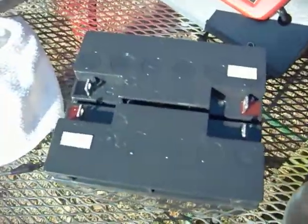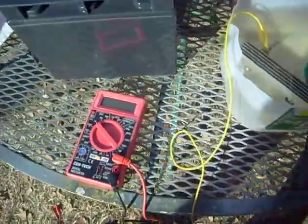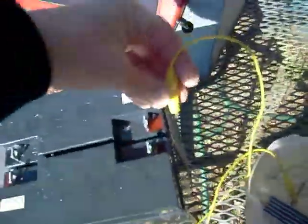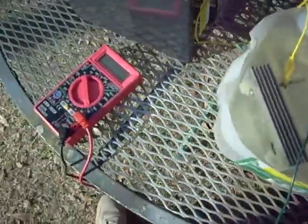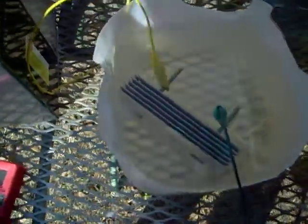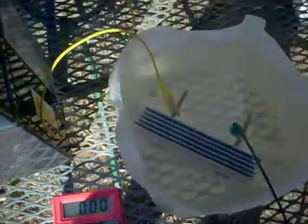This is the battery set up here, and then we've got the meter right here. What we're going to do is attach this positive to this battery lead here. We've got it going through an amp meter here, and when I put this on here it'll make a circuit. You're going to turn the amp meter on, and then I'm going to apply power to it.